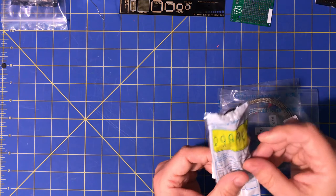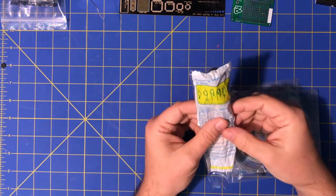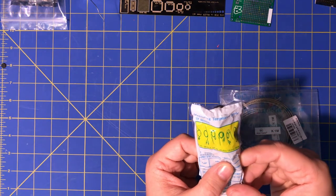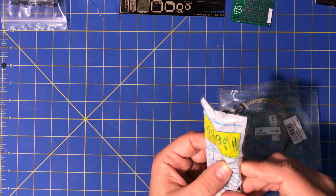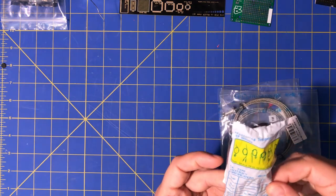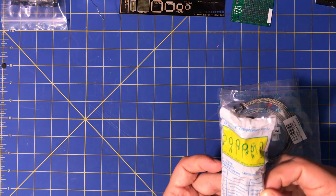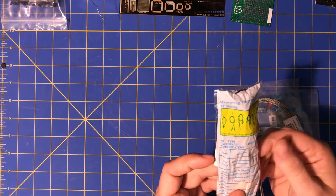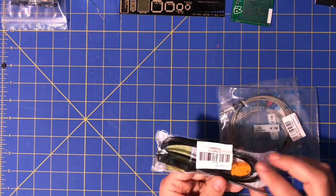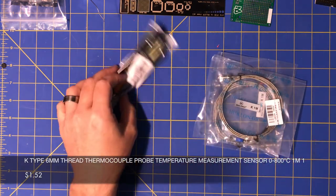T1. I think this is this one. TPO2. It's a probe with the K plug. K type accuracy less than 400C, 0.75%, plus minus 2.5 Celsius. Suitable for measuring negative 50 to 700 Celsius, which is negative 58 to 1292 Fahrenheit. Suitable for measuring temperature of the air, steam, liquid, etc. Probe is stainless steel. Sure, I can find instructions somewhere else that tells you how to accurately compensate for that. I just thought I'd read that.